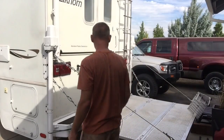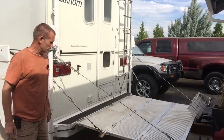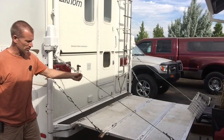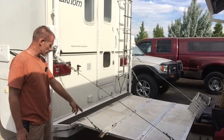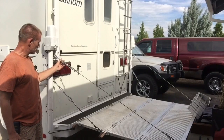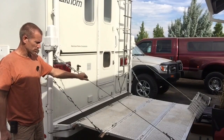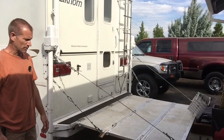It's set up on stainless steel cables — each one has an 800-pound tensile strength capacity. There are four cables going to the outside corners. On the outside of the first panel I have six-inch steel turnbuckles, so if there's any cable stretching over the year, whether in winter or summer, I can just tighten up the turnbuckle and get everything leveled out.